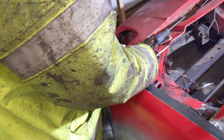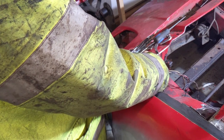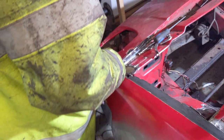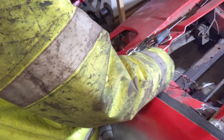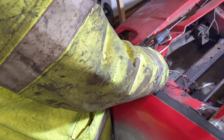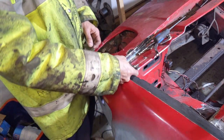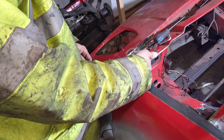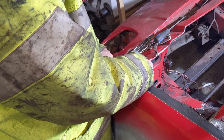So we have here my piece which I'm going to weld in here. It wasn't too hard to make but it wasn't too easy — just to get the kind of shape and the curves a little bit. That's going to go in there. What I hadn't realized is it was spot welded to this, so I've cleaned this off and put a hole in the other one, and we will spot weld this in. I just need to cut through this support here, stick a bit of weld in there to strengthen that up again. I'll do that first — put some weld in, grind it down, and then tack weld this in place.